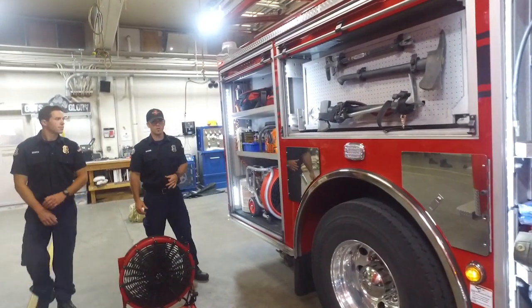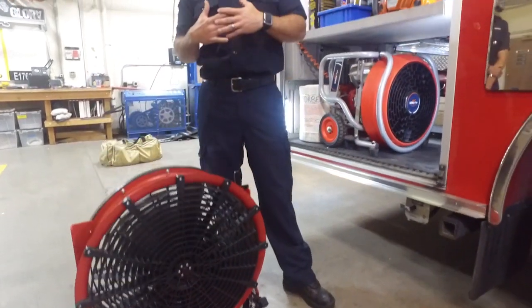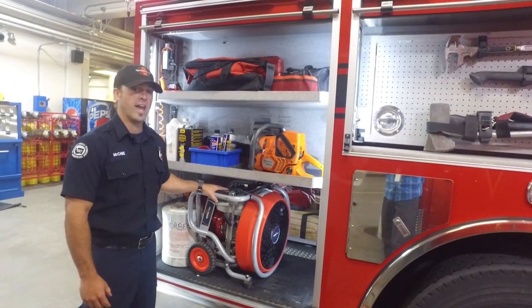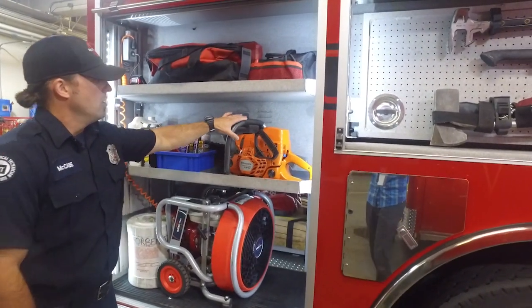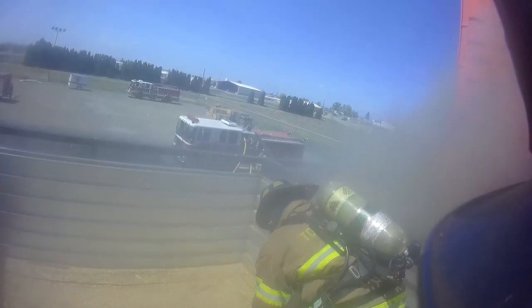In this compartment we have more tools that assist us in doing our job. We have positive pressure ventilation fans, which help us clear smoke out of a room or a building so we can get cleaner air and visibility, and then those toxins decrease. We have an electric version of that fan, and then we also have a gas-powered one that can move a little more air and run a little longer. We have a chainsaw to use to vent a house for vertical ventilation — cutting a hole in the roof or on the gable ends — and we can also use this for any other function that we need a cutting saw. It has a very sharp blade and is a very handy tool for us.